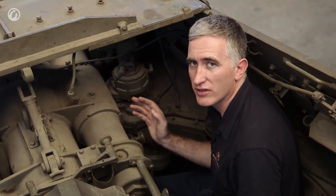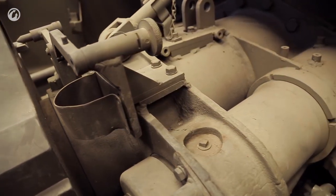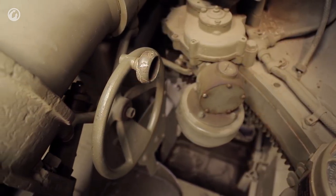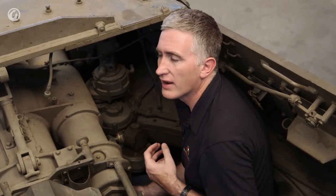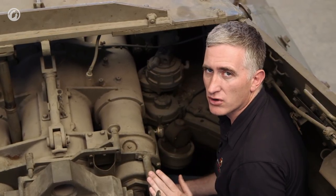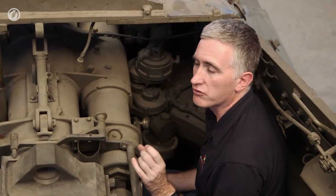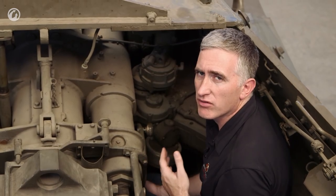The original vehicle is fairly simplistic. Both the M10 and the 17-pounder version have a simple screw for elevating the gun, with a large hand crank on this left-hand side here. The original M10 had a gun depression of 10 degrees. The 17-pounder has 5, and I've measured it — I've taken this vehicle, put it all the way down to the bottom, gone with a quadrant. This is 5 degrees.